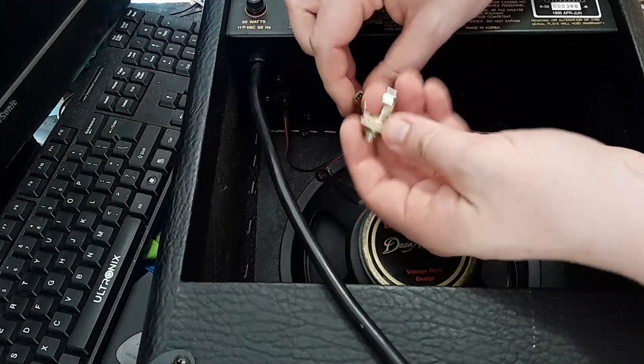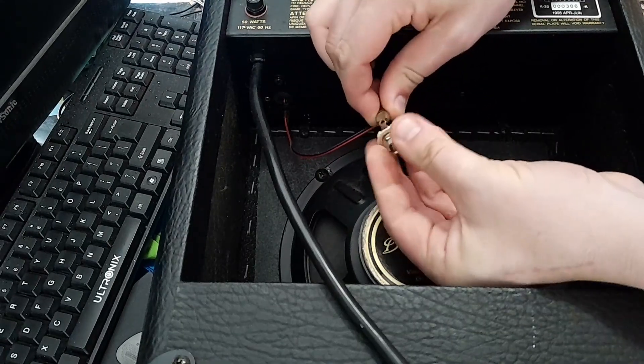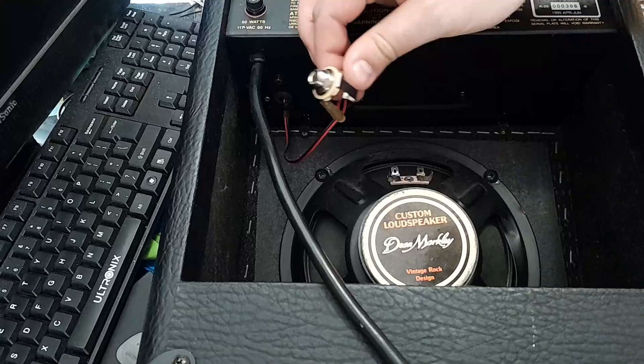The simplest way to fix that is to just add an output jack to an amp. You'd be surprised how few watts it takes to drive a bigger speaker. So if you've got a practice amp with a six inch or an eight inch speaker, don't even worry about whether it's able to drive a 12 inch speaker — it can. The simplest way to do this is to literally just unplug the leads at the speaker and plug them into a standard quarter inch jack, the kind you'd use as an output jack for your guitar. You can take the speaker leads off your practice amp's speaker, plug them onto here making sure you've got positive and negative correct, and plug in an external speaker cab. It's a reversible modification, but you will lose usage of the internal speaker until you reverse it, and it's just not quite as convenient.